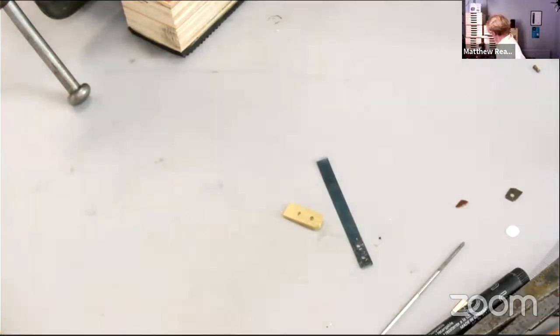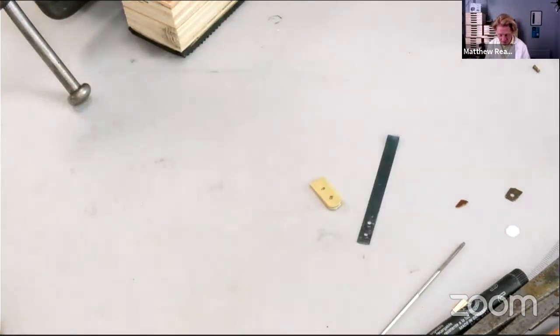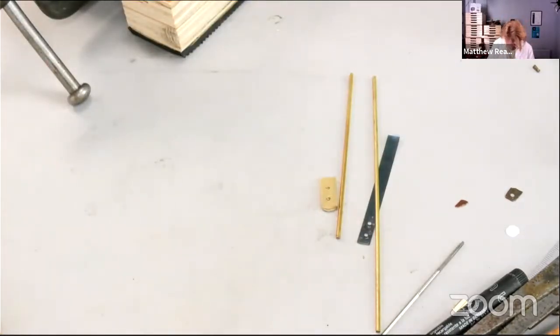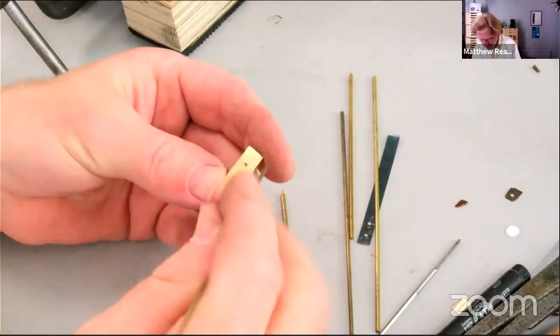Right, rivets now. Some brass wire. As always with our riveting, we want to make the rivets really tight in the first place. That's going to make life so much easier. If the rivets are too small, then you've had it really. Well, you can spread it, but then you start hammering, and don't do that. You want the rivets to be a good fit in the first place. Let's see if we've got any slightly smaller metal. Again, the old brass wire is pretty indispensable for all this kind of stuff. I don't think any of these is quite where we want to be on diameter.